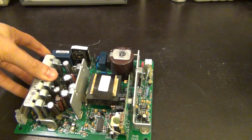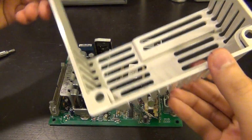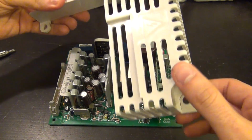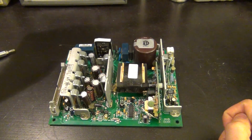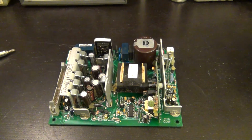Aha, there it is. There is our power supply. There you go. Let's take a quick look at that. Nothing fancy. The PCB slides in these corners so that this thing stays in place. There is no pressure on this from the screws. They go through the holes, but it stays on there to protect you. I'm assuming that this part of the circuit is live and quite at a high voltage. We'll measure it, and we'll find out.